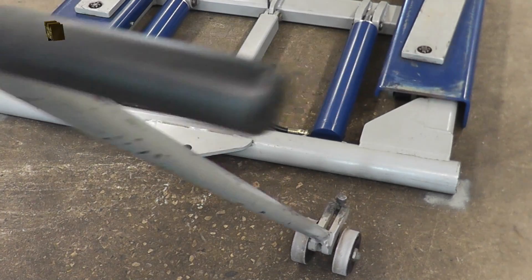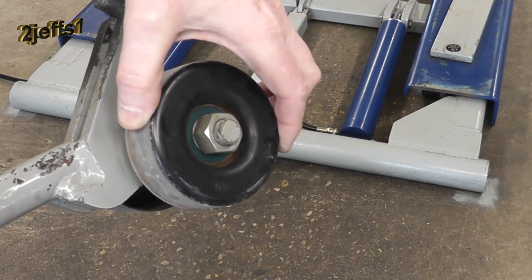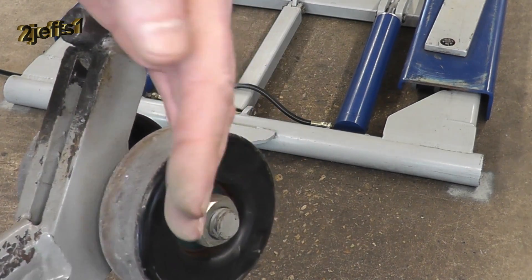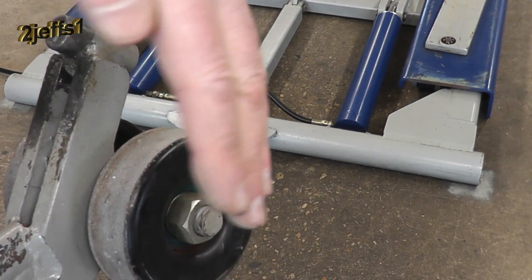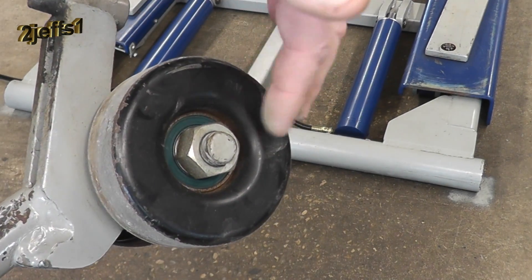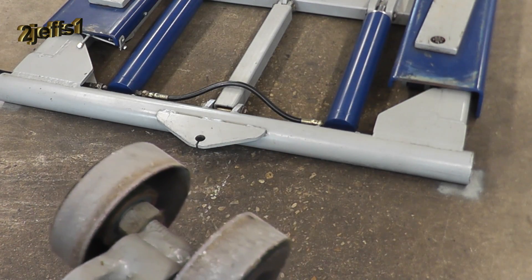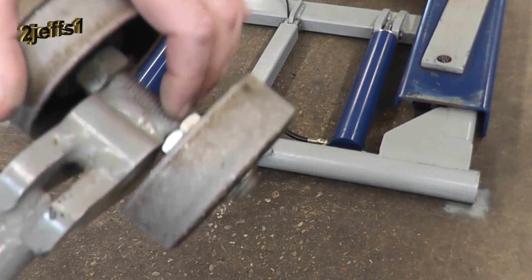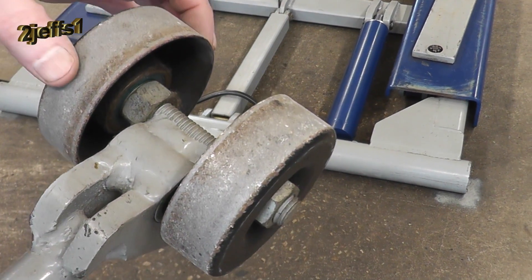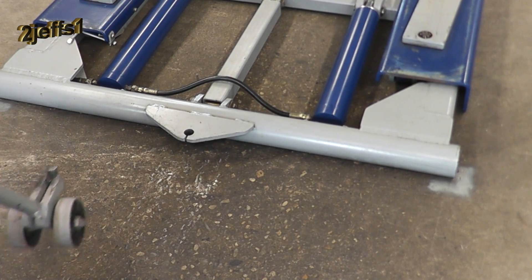Here we have the device to roll the hoist around the shop, and this has also been modified. They originally had nylon wheels on here. These are tensioner wheels off a serpentine belt — when you buy tensioners for the car and they start to run off track a little, the idlers are still good, so I always keep those, don't throw them away. They work great for this — it rolls much easier. The other problem was if your floor is a little uneven it wouldn't raise high enough, so you're skating the whole bottom of the hoist. I put a piece of 5/8 threaded bar here so when you lift it to move it you get a lot more height. I always spray paint the floor so whenever you move it you can always get it back in the same position.